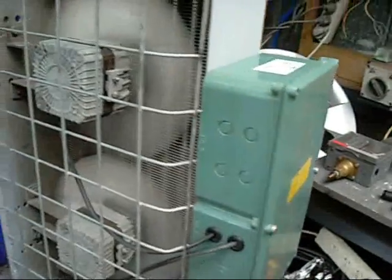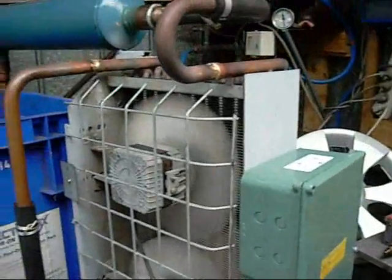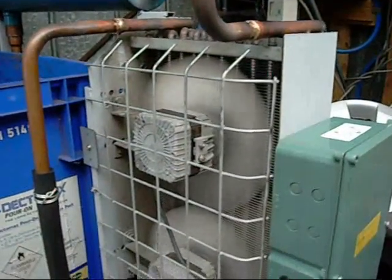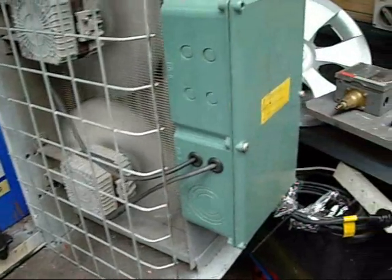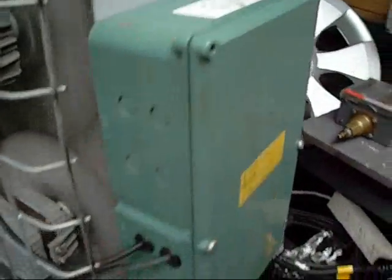I've got to go shopping tomorrow and get a few more fittings and a waterproof power switch to put on this — I don't have anything with that rubber outer seal on it. The key thing here is I'm mounting a 240 volt AC supply near water piping, and this enclosure is waterproof with a nice seal on it, but everything else that goes into it has to be sealed as well. These fans are sealed — they're okay, they're designed to be mounted outdoors and get a bit of moisture through them. The main thing is to keep the AC power out of the water.